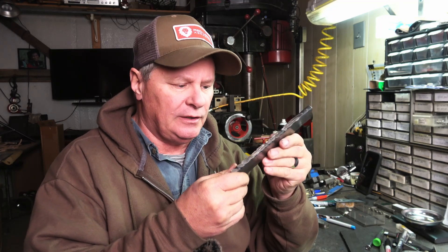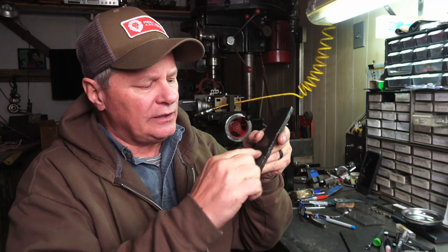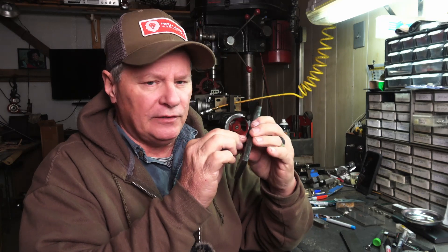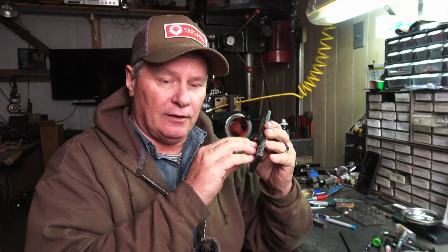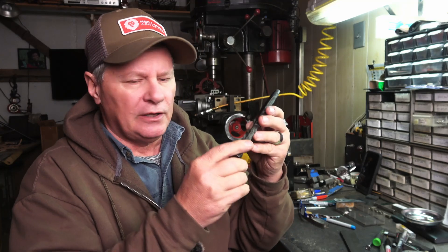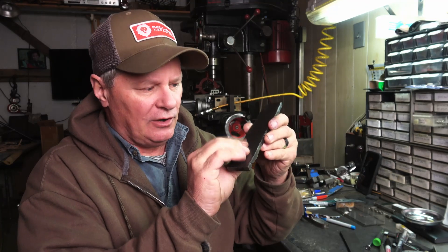A little more on why I'm leaving this billet so thick — as you grind down, of course, this pattern is going to change. It's going to get a little tighter. Where these twists intersect, you'll create a cross in there, where they're crossing, and you'll have these diamonds. Straight twists have very pronounced diamonds, and the further you grind in, the tighter they get. But these are W's — 252 layers of W's — so it's going to produce some unique stars, hopefully. That's why I'm leaving it like that. As I grind down, this will change. We're going to have to do that on the next video — we're out of time. If you've got any questions, leave them in the comments. Hope you enjoyed this, kind of a day in the life of a bladesmith. I want to thank my patrons, and thank you for watching.